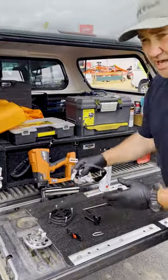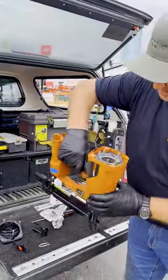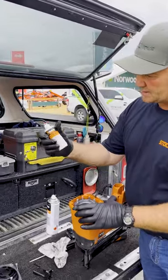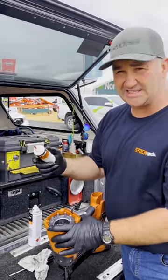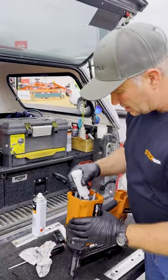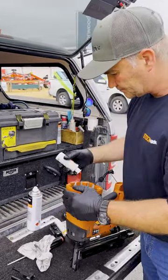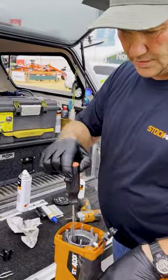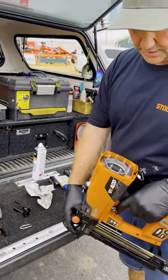Because this is alcohol-based degreaser, it dries really quickly, so this will be dry now and we want to re-oil the tool. Using the Paslode lubricating oil specifically for impulse tools — it's got acetate in it so it's not going to burn off. We're going to oil around the piston bore, then push the piston up and down three or four times to get that oil around the o-rings that are around the piston.